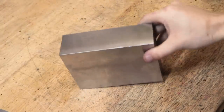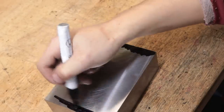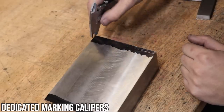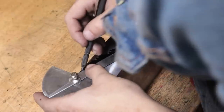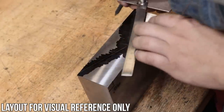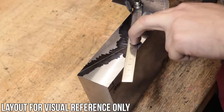And that is the part squared up. Now the plan is going to be to machine both parts as one piece, and then at the very end I can cut them in half. Doing it this way should help the parts match up. The V-profile that I'm aiming to cut is 130 degrees, and that was mostly dictated by the height and the width of the stock. That should allow me to clamp onto some very large pieces of round bar.